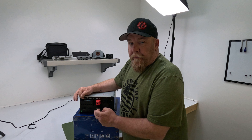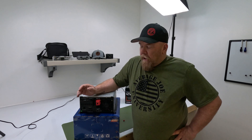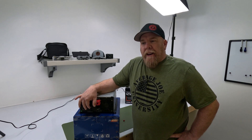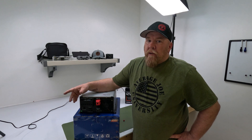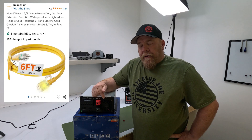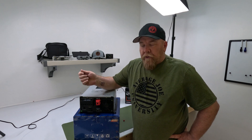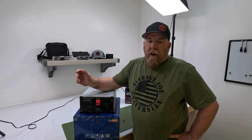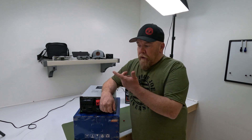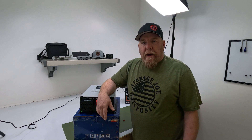Power cord. I looked on Amazon for a replacement power cord for a power tool or similar, and they're not as cheap as you would think. Even though I'm only going to use the 10-amp outlet, I wanted 12-gauge wire. I could have used 14 or even 16 gauge and it would have been fine, but I wanted 12 gauge. I found a 6-foot extension cord for $8.49 — I'll post a link in the description. You simply cut the end off, strip the wires about a half inch, and use it. You could also take an old computer cord or a cord from a broken power tool and cut it off, or just order a cord.